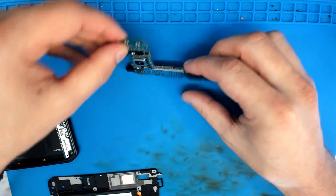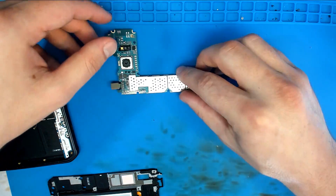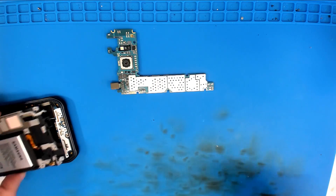This is where our heat was, and if we flip the board over we've got a spot here. I'm thinking since we have 300 milliamps of USB current even without a battery hooked up, something has to be like shorted — that's way too much current for not actually charging the battery. Let's have a look at this board under the microscope. Here's the area where we've seen the heat, and I guess there is some stuff going on under that shield.